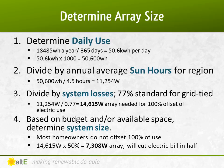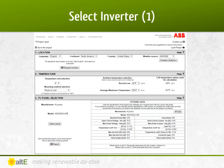Now let's use this information to pick out the rest of the system. Grid-tied inverters are sized based on the size of the solar array they are connected to. There is a certain window of number of panels in series and parallel that will work with the inverter. When selecting the inverter, most inverter manufacturers these days have an online calculator called a string sizer to help select the right inverter for your panels. We'll walk through ABB's string sizer to find the right inverter and panel configuration. I enter the temperatures that the panels will be seeing during daylight hours and if I'm mounting them on a roof or on the ground. This matters because the solar panel's voltage changes pretty dramatically based on temperature, so the string sizer needs to calculate the highest and lowest voltages it will see. I'm also selecting the solar panels I'm going to use — I picked Kyocera's 250 watt panels. They're a terrific panel at a very good price.